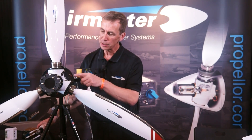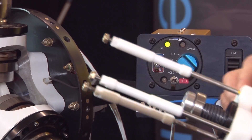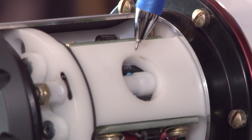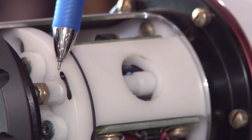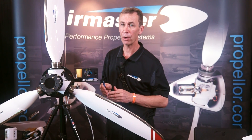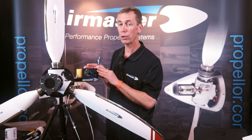The last thing I'd like to talk about is the electrical pitch change stops which surround the pitch change motor at the front of the hub. The cams that are part of the pitch change block assembly move up and down as the propeller adjusts. Here's the cam in working position — the little blue button is part of the micro switch which gets activated when the cam comes up to it. At the top of the cam is where you adjust to set the position you want. For the fine pitch cam system, you would set this cam so that the propeller can achieve the maximum RPM for your engine on takeoff. This sets the range of pitch the propeller can operate within, and then the controller operates within that pitch range to do the final constant speed function.